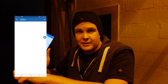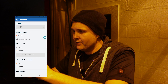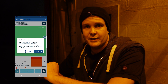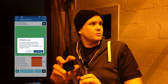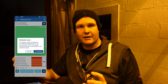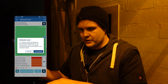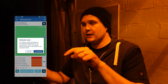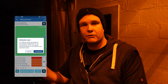Gallery is basically a place to store pictures in the app. Settings has a number of options you can work through. To calibrate the device — which you should do every so often as readings can drift with weather or over time — you use the two included calibration modules. In calibrate mode, you apply the device to the steel plate, then the aluminium plate, and it needs to read 90 microns. Once done, your device is calibrated and ready to go again.